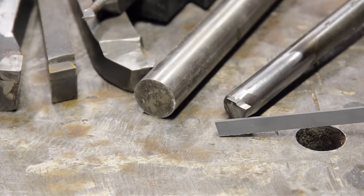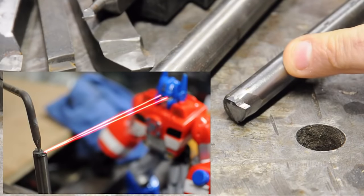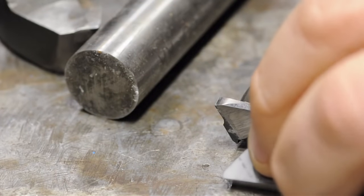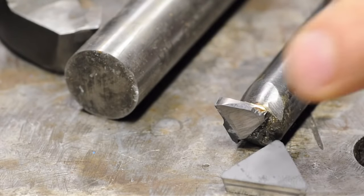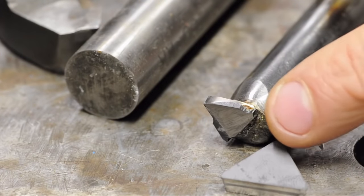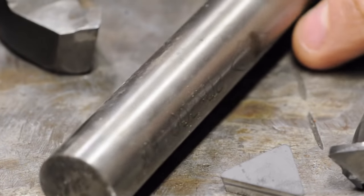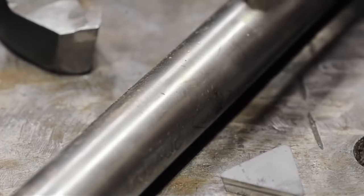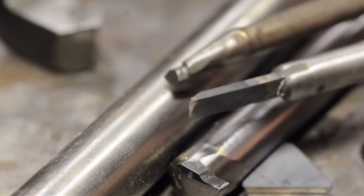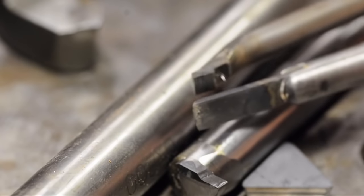I just take a piece of carbide and glue it to the end of a convenient support. This is the little undercut tool that I used in the coffee pot video. In this particular case, I think it was just one of these inserts I don't have a holder for. I didn't even really need the properties of carbide, but it just made a convenient tool — I just needed to reach in there and do a little undercut in aluminum. Brazed carbide finds a lot of uses down here in my garage, like creating scrapers.